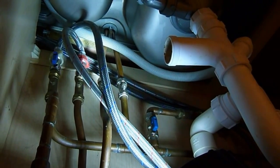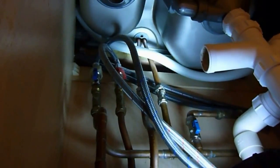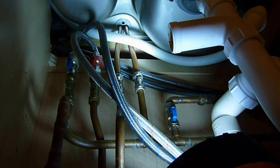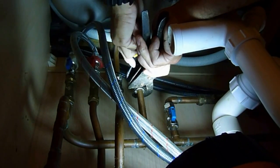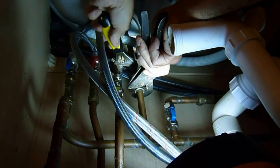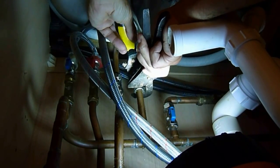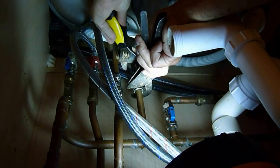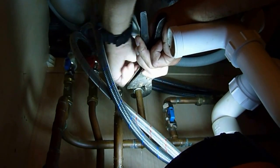The next stage is to undo the union nuts on those pipes - you can see them just there. There's a lot of things in the way so it's a little bit awkward. I've loosened them already, but you'll need a spanner on there and another spanner to hold against while you undo it. Otherwise the whole valve would turn around. If you don't hold against it with a pair of footprints or another spanner, that nut's going to turn the whole valve and it will cause a leak underneath.